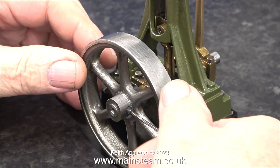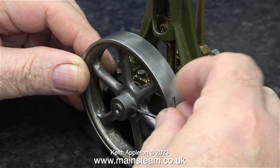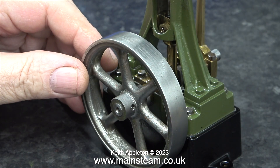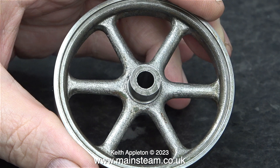Time now to go into the workshop, which is built onto the house and is a good bit warmer in here. What I'm doing is removing the grub screw that holds the newly machined flywheel onto the Stuart 10V. This flywheel is much better since I re-machined the centre bosses and tried to true up the spokes and the internal part of the flywheel.